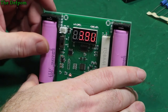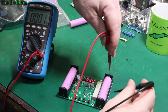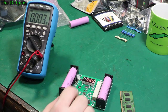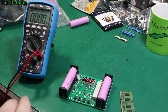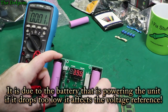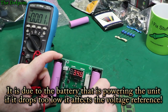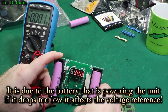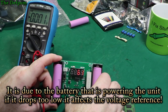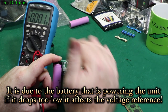It's still only 3.9 volts on the display. It hasn't dropped down yet. So this is still saying 3.9 volts - let me check: is it really 3.9 volts? I stick a probe on the battery - we're getting 3.4. That's not 3.9. So if I stop it, it's still saying 3.9 on the display but the battery is 3.4. Why is it saying 3.9 volts when that's actually not what it is? It looks like it's actually not reading the battery voltage correctly. So far it's pulled out 61 mAh. Still says 3.9 volts after a reset. I might need to look into this one a bit more because it doesn't seem to be correct.